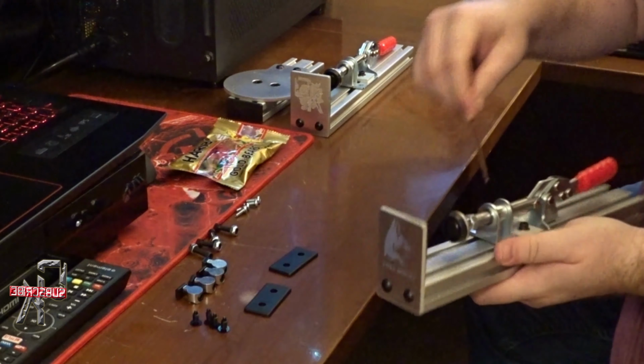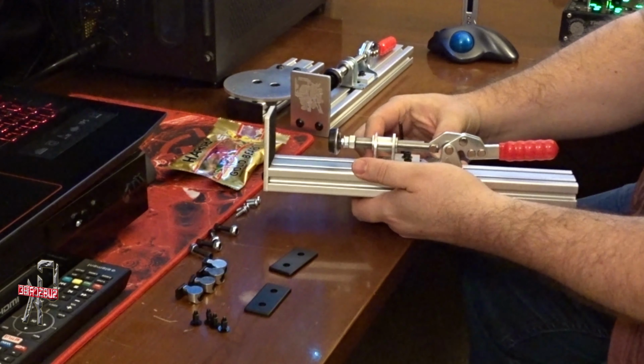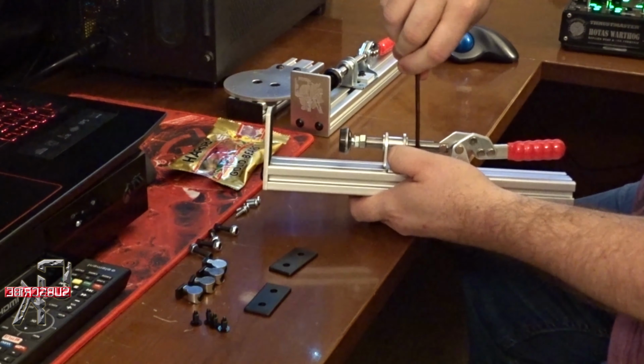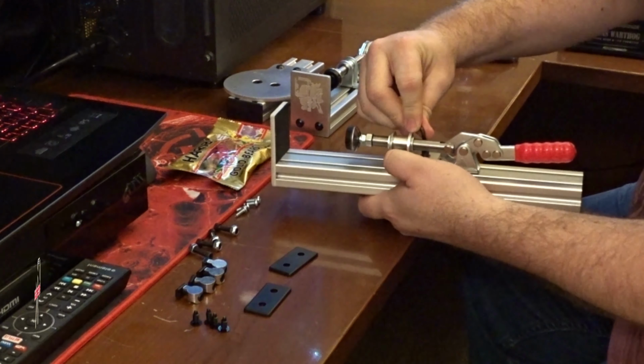The easiest thing to do is to set up your dimensions on your desk, so figure out what the gap is, and all you have to do is get in the rough general area. You don't even have to be exact. You have the mount slide, which allows the latch to actually move, that you see me adjusting there in the video right now. And then at the very top of the latch, it's got a lock and thread bolt there. So essentially what happens is the nut that's directly underneath the foot, you loosen that up, then it will allow you to thread the foot out a little bit more for that fine tuning. You get about an inch or so that you can extend it outward.